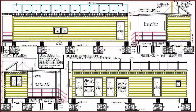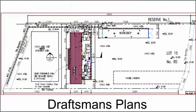Here's a side view which shows the cement pads and piers. I need five down each side, and they're a metre square by a minimum of 800 millimetres deep. So they're quite substantial — I think personally it's a bit of overkill, but the legislation demands certain things, so I had to jump through some hoops there.